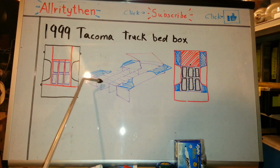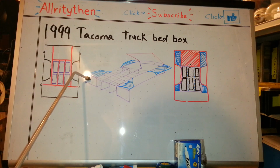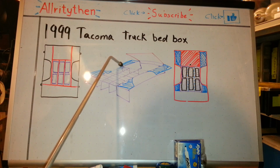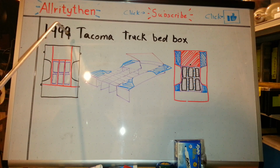The material for the top is going to be all 1/2-inch plywood. This divider here, that divider is going to be 1/2-inch plywood. I put this fascia as a 1/2-inch ply. But the main frame, this red frame that you see here, just this side, and this little piece are just repurposed wood, man. Pieces of 1/2-inch pine, or I took a 2x6 and cut that in half, and I used half of it for here and half of it in here. So I just kind of used materials that I had. The only thing that I had bought and had as a spare was the whole 4x8 sheet of 1/2-inch ply.